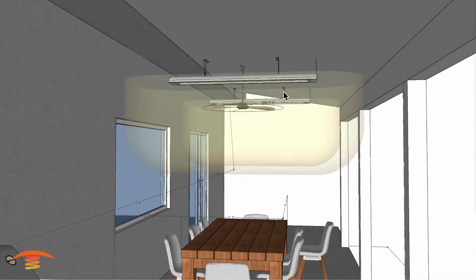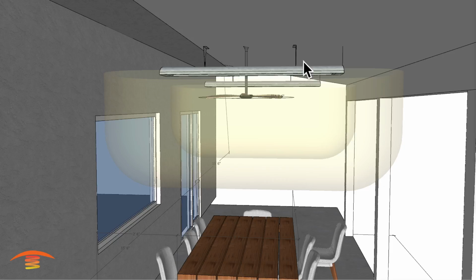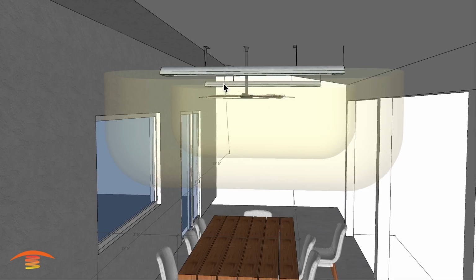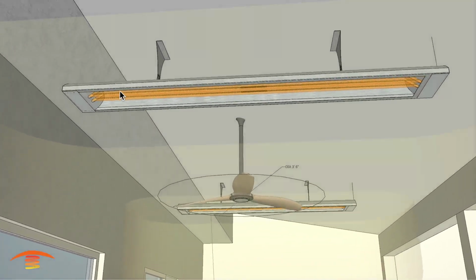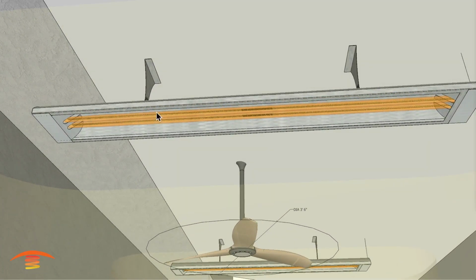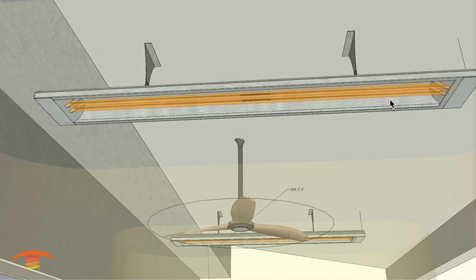So it's very important that you maintain a level installation on the heater itself, because you don't want the elements inside here. There's nichrome wire in here, and that will start to slide downhill if you do have it at an angle, and that will destroy the elements.